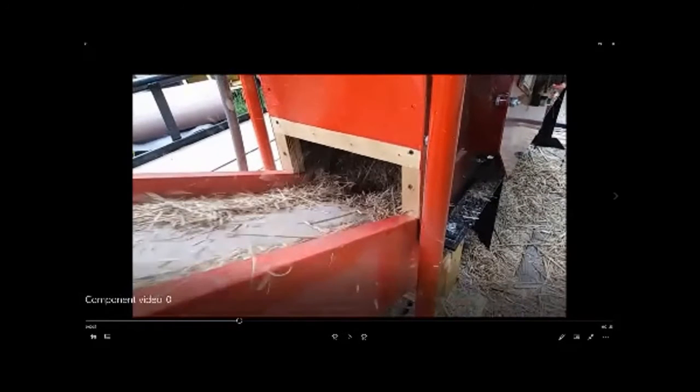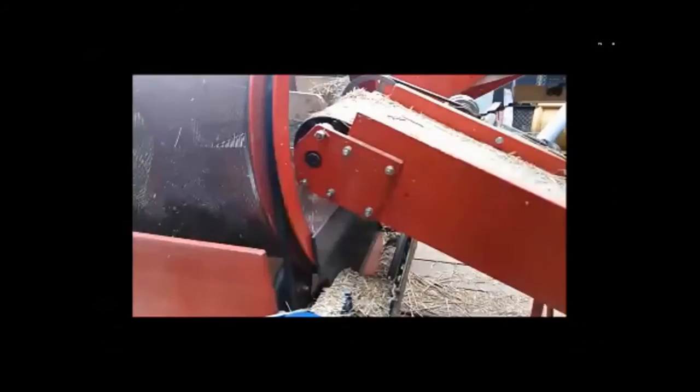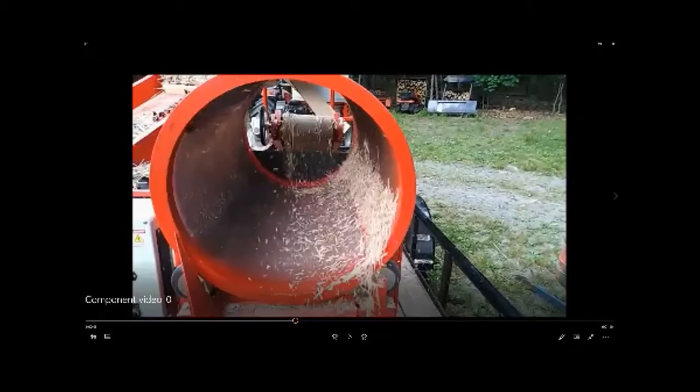This opening coming out from under the hammer mill drops is up in here and the material drops down, this opening needs to be enlarged. The drum switch needs to be mounted along somewhere here on the end so we can reverse the roll of the trommel mill, so that it drops the material off the left side rather than off the right side.